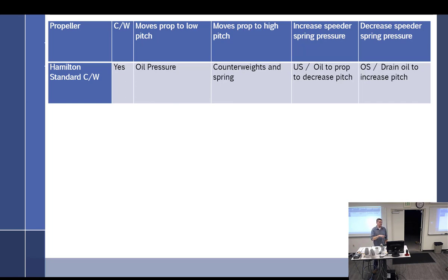How do you get the oil from the prop governor to the propeller? Starting with the governor, then a steel fitting, then a stainless steel tube all the way to the front, through the crankshaft. What if it's a Continental? It comes through the oil gallery into the governor, back into the crankcase, then to the oil transfer collar, to the crank, through the front, and up.